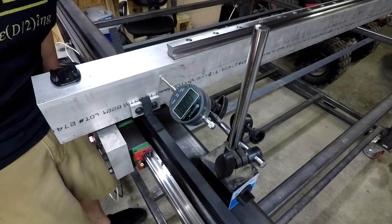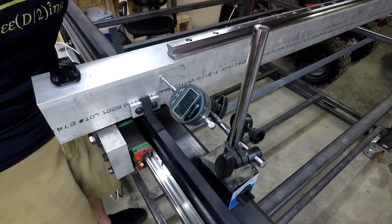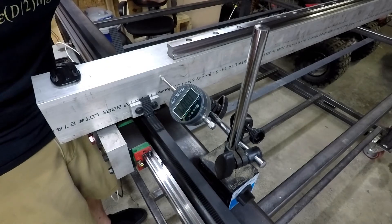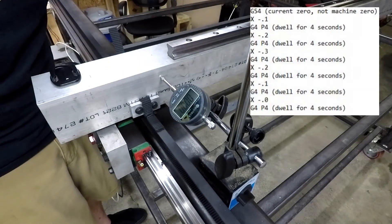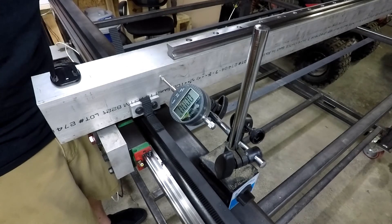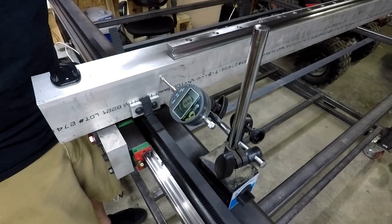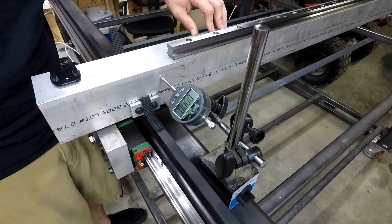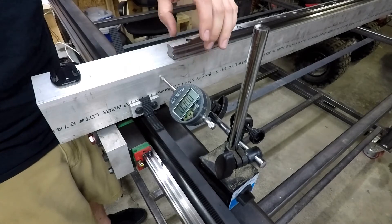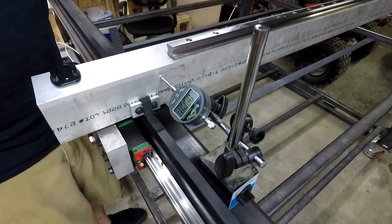I've loaded some g-code that I wrote — it's just a very short program. It tells the machine to move to 0.1 inches, 0.2 inches, 0.3 inches, then back to 0.2, back to 0.1, and then back to 0. I have the indicator set to 0, so let's go ahead and run that. I'll do a screenshot so you guys can see what that g-code looks like. It's really not too complicated — I've got a four-second dwell in there, and I did put some comments in. This is formatted exactly how Mach 3 can read it, so if you guys need to do a similar test, this works on both plasmas and really anything controlled by Mach 3.